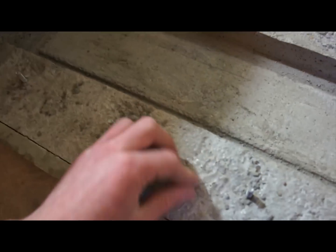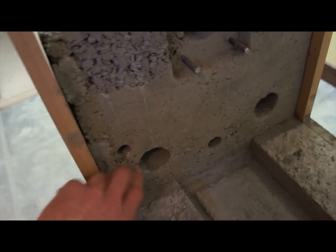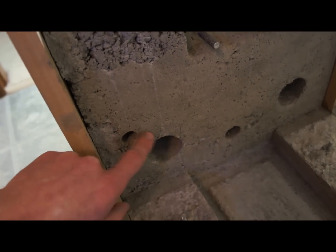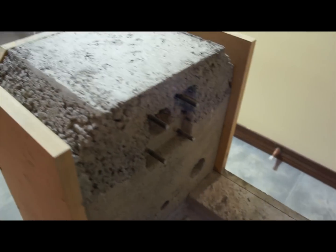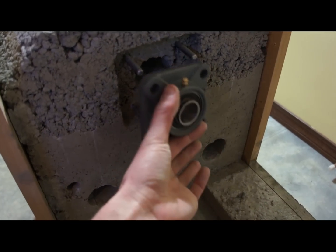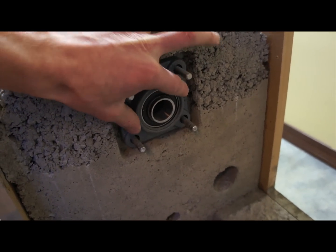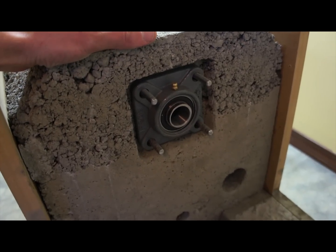I've taken a brick to work over the edges and smooth them off while the concrete is still somewhat soft — soft being a relative term. All these little bolts are cast in really, really well. This doesn't have to be a reference surface because there's going to be steel on it, but it's decently flat and I'll work off the high spots with a brick. These came out great. The bearing I'm going to use fits like a glove — plenty of room to move — it just sits dead flat against the casting. Super happy with that.